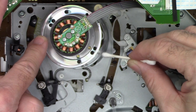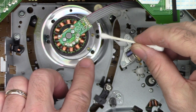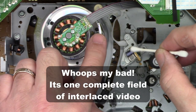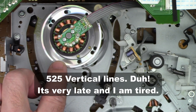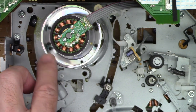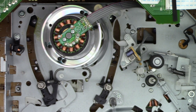The reason they put these two heads so close together — only a few horizontal lines apart — is that this spins at 1,800 RPM, and the distance from one head to the other is 180 degrees, which is one horizontal frame of video on your TV. NTSC video has 525 horizontal lines per frame. Once you get into high definition, that's a completely different story: 720p is 720 by 1280, and 1080 is 1920 by 1080. This VHS mechanism is not compatible with high definition — it's only standard definition. I hope you enjoyed this quick tutorial on how NTSC video works.